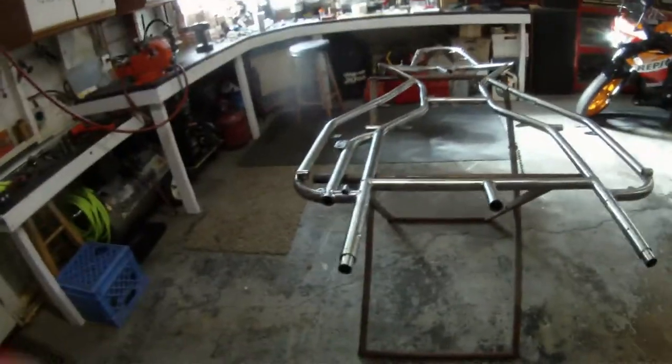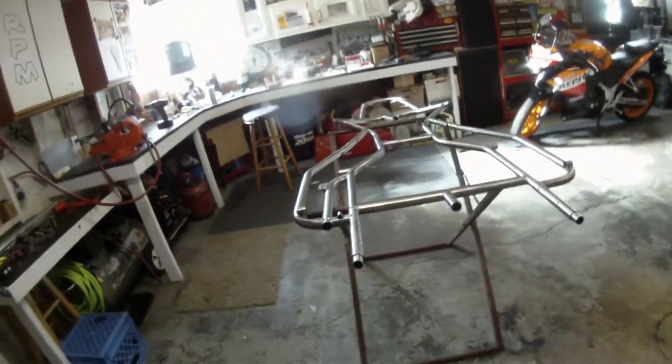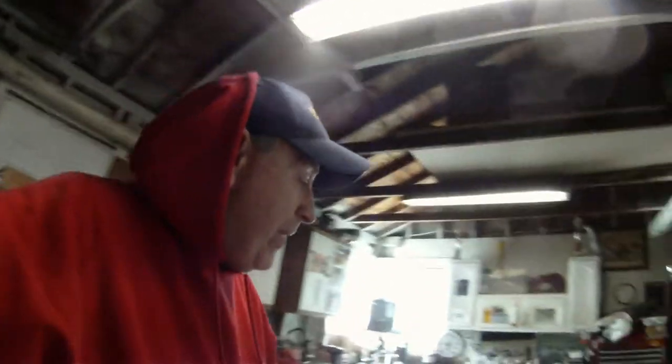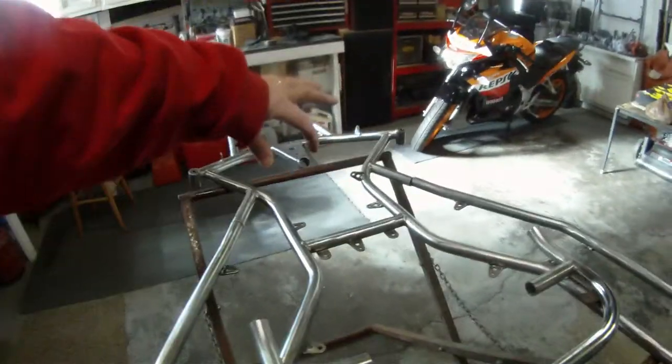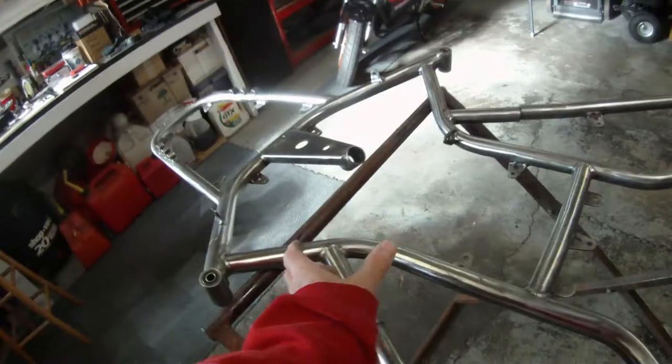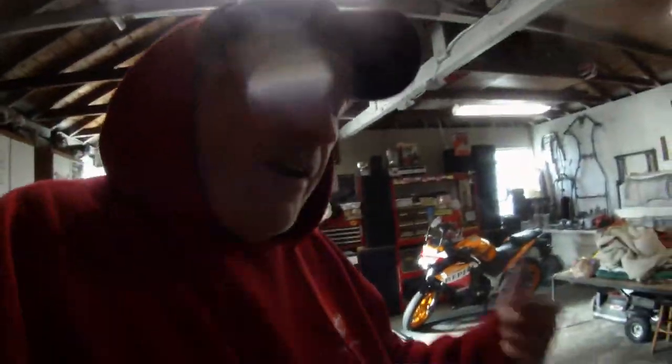This inside tube deal — if we were building this cart from brand new, we wouldn't put bars on the outside. Here's a tip, a trick, a hot tip right here — get out your notepad. If you build a chassis and you're testing, you're happy with the width of the waist, the length of the waist, all this stuff here, but it just needs a little of this or a little of that — what you do is take chrome moly and insert it into these frame rails, depending on whether you want to stiffen up the front end, the waist, or the rear end. You would push it into sections of the tubing before you bent it. Then you wouldn't need to plug weld it — it'd already be in there.